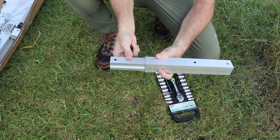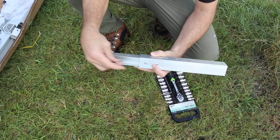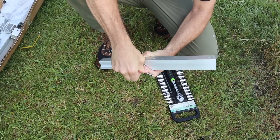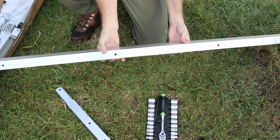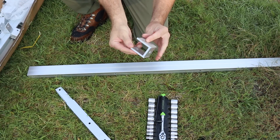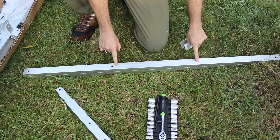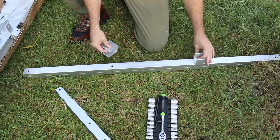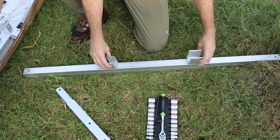For us, we're going to set it at 35 degrees since we are at a 32 degree latitude. Tighten these set screws so it stays there. We're going to take one of these long square beams and add to it one of these small brackets and then a large bracket. All the holes on this beam are drilled equally, so one of the small brackets goes at the top and one at the bottom.